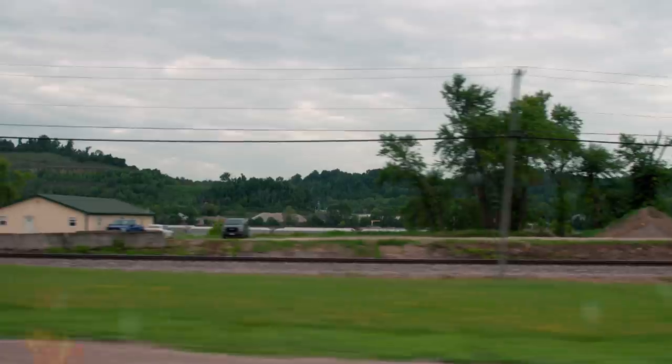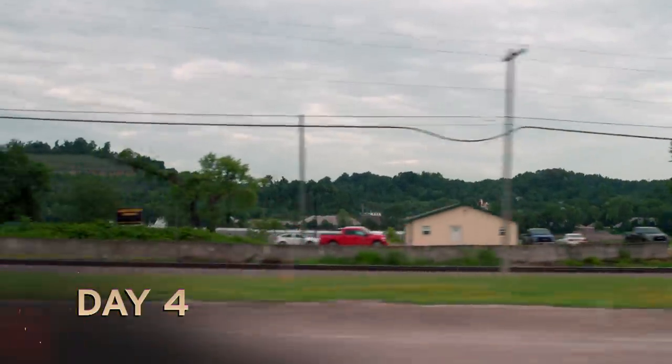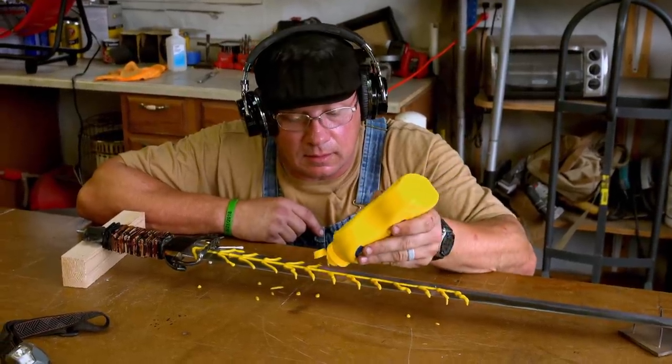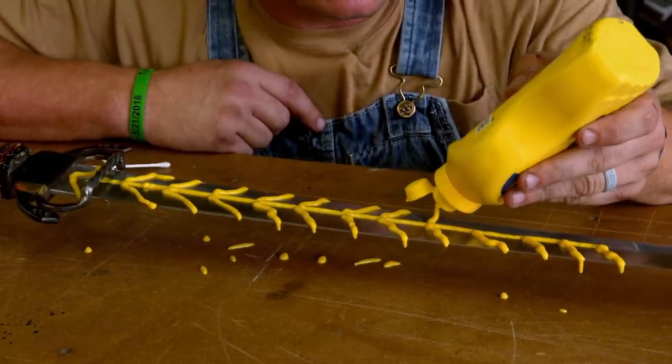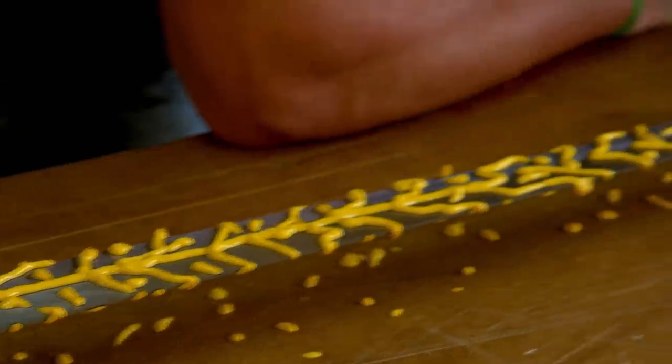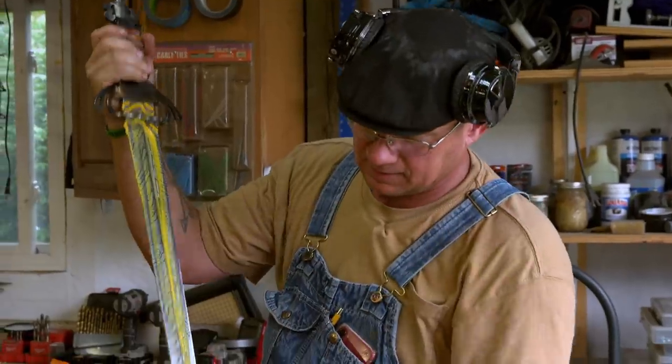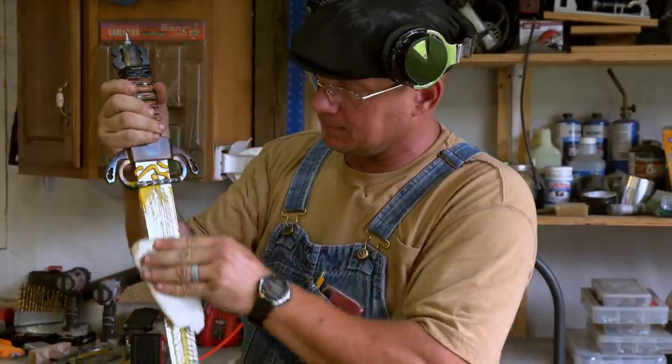Even if you feel like you can't do it, just give it a shot. You really never know what's going to happen. Here we are, the last day of this build. Everything's progressed nicely so far. Now I'm going to start the mustard patina process. Basically, the vinegar in the mustard reacts to high carbon steel — the blade begins to slightly rust, and you wipe it off, and you have a nice little outline of where your mustard was. I am very, very, very happy with that.